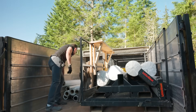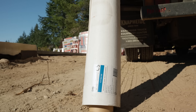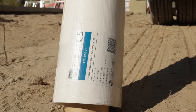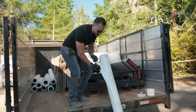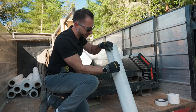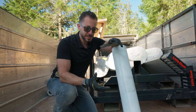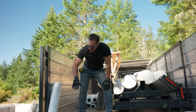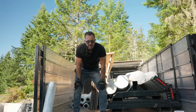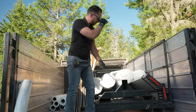So when it comes to the major products, this right here is the Viper CS for crawlspace. It's a cross-woven product. It uses virgin materials instead of recycled. I'm pretty sure this is a 10 mil product, and there's no way I'm tearing that. During construction it's going to be more durable. There is a time and a place for recycled content, but in this case you really only have one chance to do this right. This product is going to be stronger than what you typically see as a 6 mil vapor barrier. Mil is not short for millimeter, just so you know.